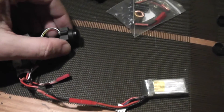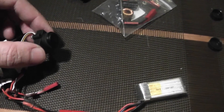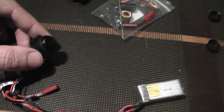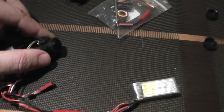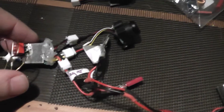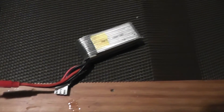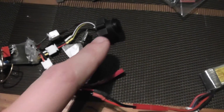This time I made another change. I use another 170-degree field-of-view camera which is the MC495-170, which is more or less the same as the MC95AB18. You will see that with the Boscam TX5823, we will observe less interferences. It's exactly the same setup, the same voltage regulator — I only exchanged the camera.